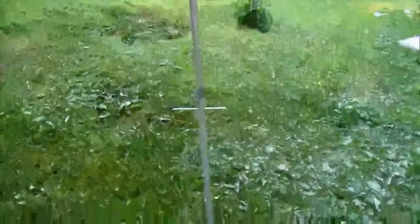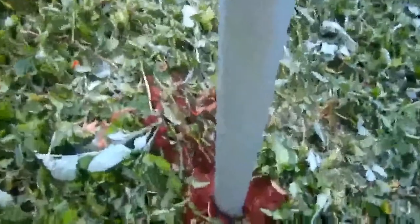The post I've run in is hard red clay dirt, so I didn't have to run it in very far — just over the top of the auger. If you were putting it in sand, you would probably run it deeper to give it more security and support.